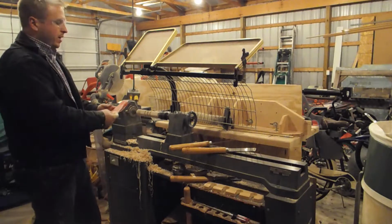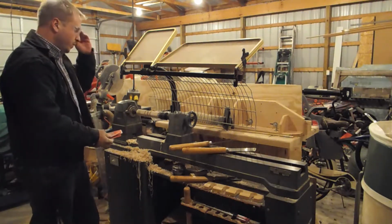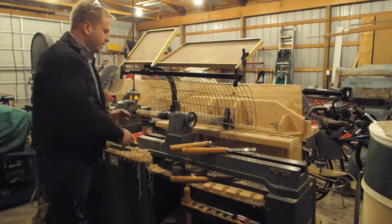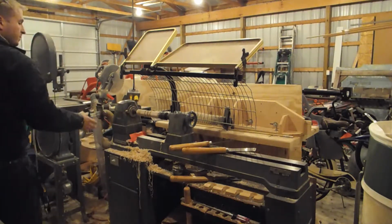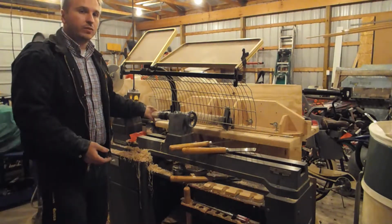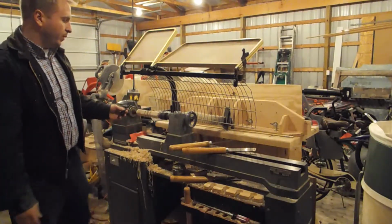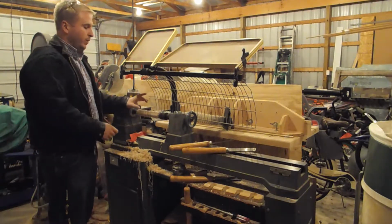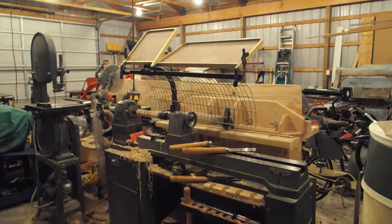Alright, I'm not going to work my way all the way through the grits, but like I said, start at 150, go to 220, 300, 400. I don't really see a need to go much higher than 400. A lot of people do, and you can if you want, that's fine. These aren't very symmetric. If you want it to be fairly symmetric, I would set it up and use calipers. I've even used a pattern before and spaced it all out, both in terms of diameter and width. Some basic things you can do.